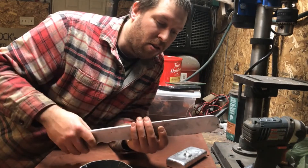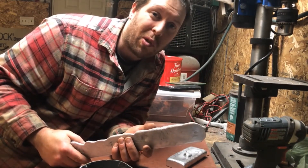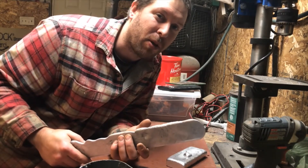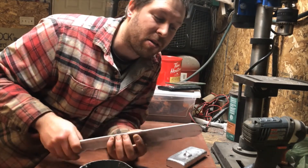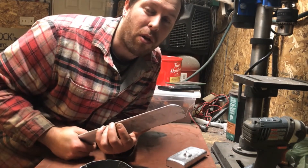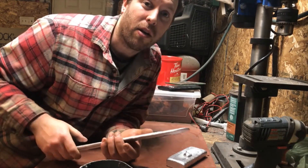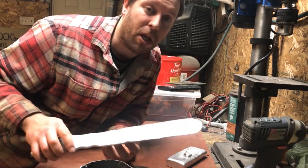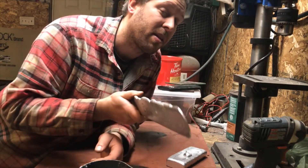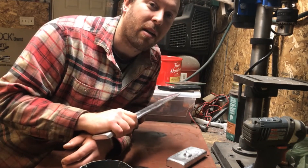So this is why I don't tend to burn those scraps too much anymore. That was number one of the garage clean-out melts. I usually do the dirtiest and least favorable ones first. Next we'll do the second worst ones - the dirty grimy parts that are going to put out a lot of smoke, but a different kind. That one's going to need to be done in nice weather again with all the doors open, fresh air going through, with a respirator. It's going to be a much better yield and we'll see how many different bars we make, and maybe make some aluminum shot with it. Stay tuned!